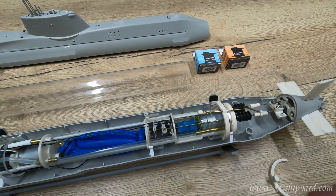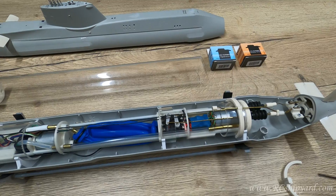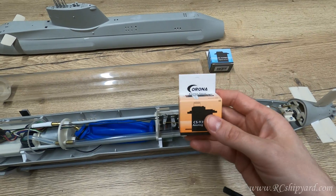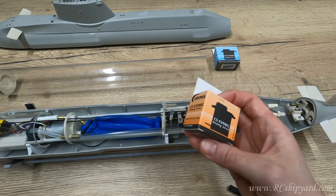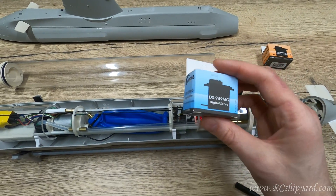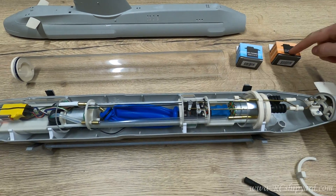The third difference is that I had to switch the servos because of this pitch controller. I was already using very good, high-quality Corona servos with metal bearings and excellent electronics — I highly recommend those — but I had to switch to the digital ones, which are more expensive but better, and they are the improved version of the analog ones.